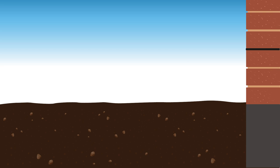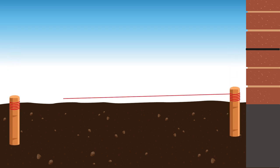It is important to lay your paving with a slight fall — a very slight slope to allow surface water to run off to drainage gullies, channels, or soft landscaping. For block paving on a driveway this is usually a minimal fall of one in 60, meaning one centimeter of fall for every 60 centimeters of distance.